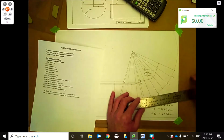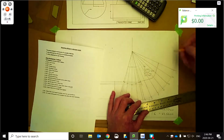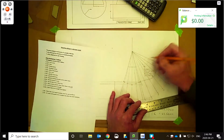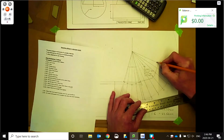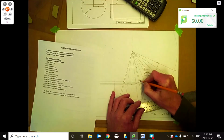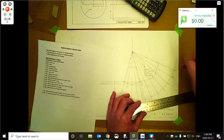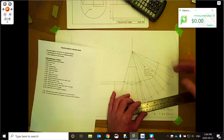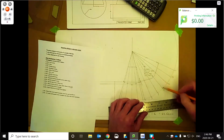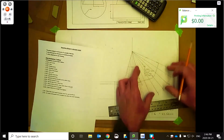Okay, identify the center line. So this here is the center line. Better put some quarter marks on there. These would also be quarter marks on the outside. Just want to make sure you punch the plate. Those are there, especially if you flip this over and you use this full scale, because you could put this in the rolls. So chances are you would lay this out on full plate, but you would probably cut it off along here somewhere, so you're not wasting so much material.